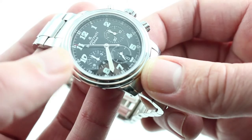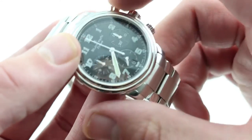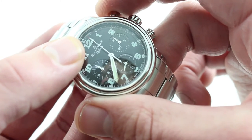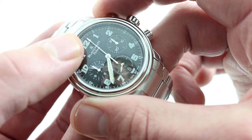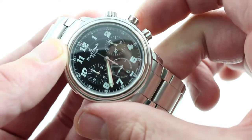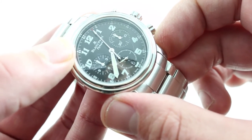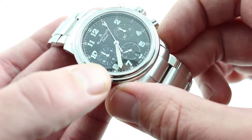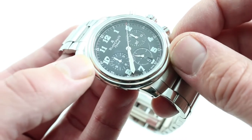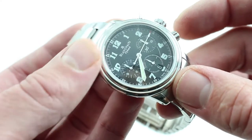You also get automatic winding with a 40-hour power reserve. With that vertical clutch mechanism, I'm going to show you conventional actuation of the chronograph. See how it doesn't jump when I activate it? Watch the chronograph seconds hand — smooth progression, stops without stagger, resets perfectly to the index at 12. And because you can run the watch continuously with a vertical clutch, it allows you to have seconds, hours, and minutes at center without any additional hazard to the movement. On a lateral clutch system you want to use the chronograph sparingly — not so here.